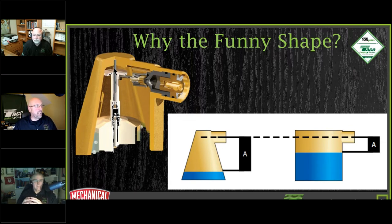And here's that guide, as you can see, to make sure it rides true. And this guide that we have here at the top and the one at the bottom, this is also really important. You take a look at our basic float in a can vent or any shape like this, the float mechanism is about the same size as the can. And if you get a little cocked on these things, as you can see by the float, it's now cocked, and it's going to rub on the sides and create a little bit of friction and maybe not move the way you want it to. And I know everybody out there is trying to make their systems as plumb and level as possible, right?